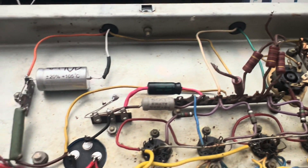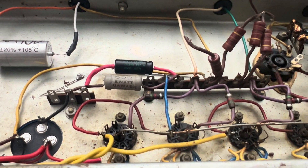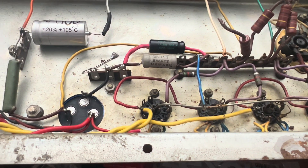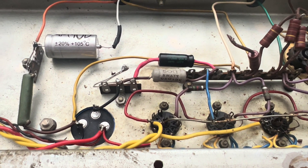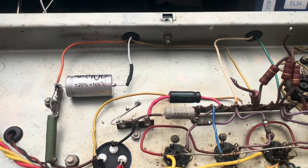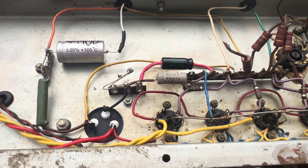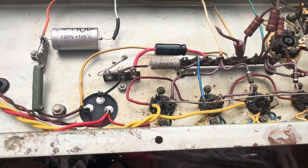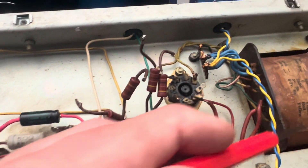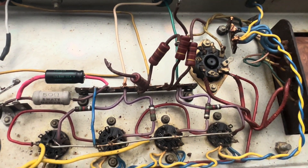I will be moving these up to 1Ks just as a prophylactic measure. It's not going to change the tone or feel all that much. When you start going around 2K, then you'll get some more compression and all that. And speaking of ideal operating conditions, you're looking at a day and age where the wall voltage is up to 125 nowadays. So that's going to push these guys quite a bit over the margin of safety for these tubes. It's a limitation of the original switch on the primary end — you have a ton of different taps, accessible by the selector up top.